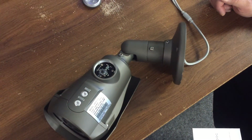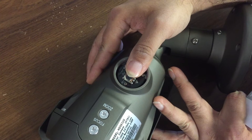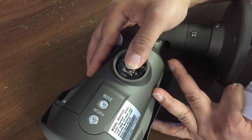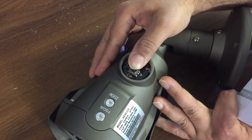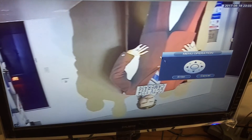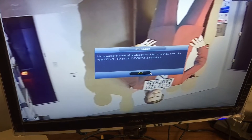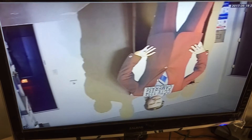If you want to set the camera to analog mode, you can set it by flicking the switch up and holding it for six seconds or so. You have to make sure that you're exited out of the menu first, otherwise it won't let you exit. Now the camera shows resolution change to CVBS mode. In this mode, you cannot enter those PTZ settings anymore because analog signals do not allow PTZ data control — it's video only.